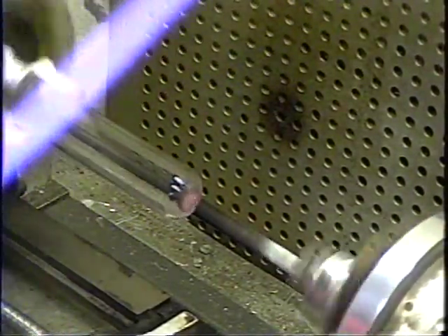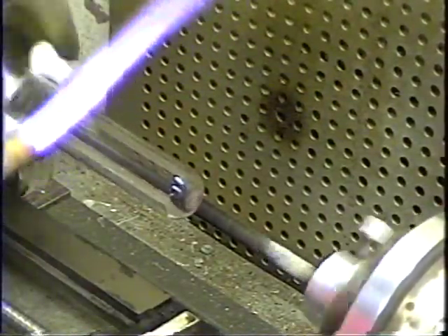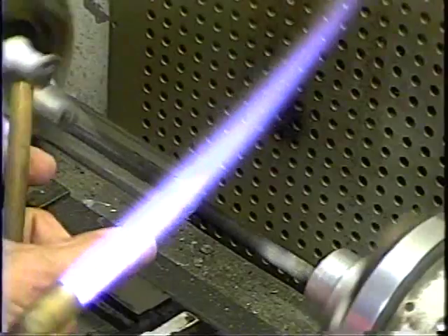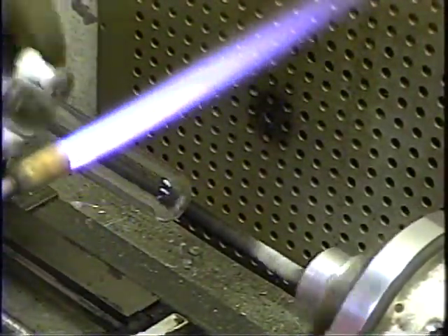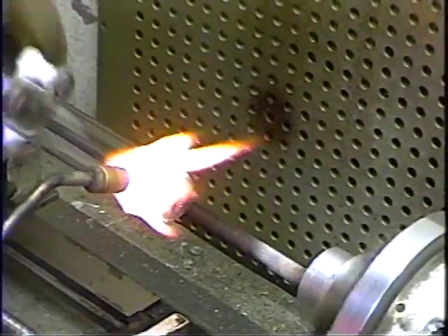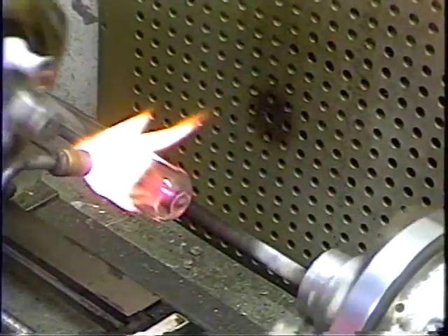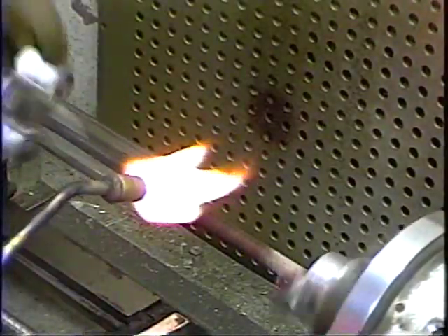Next, we're going to blow the envelope — about two inches in diameter. We're going to make about two inches of glass hot, then put pressure on it through the pressure tube to blow the envelope. We'll heat the glass until it's about like peanut butter. We don't want it too soft or the envelope won't be round or spherical. If the glass is stiff like peanut butter, it'll form a perfect spherical shape.